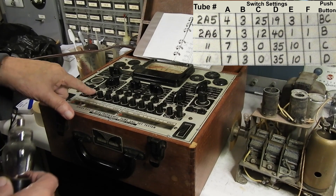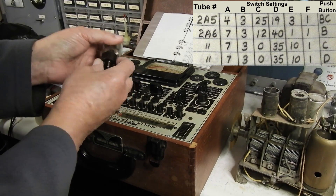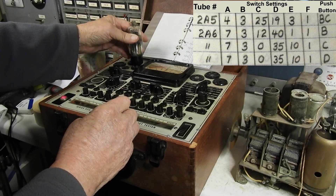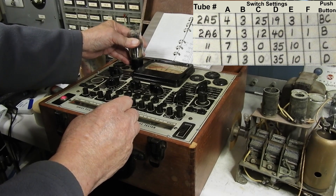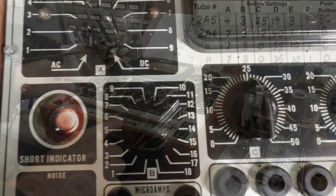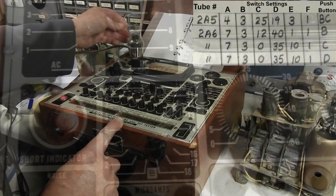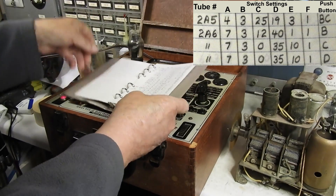I've got this on filament continuity, so when I plug this in, there's the 2 big pins - it goes in this way. From that angle you probably can't see, but the short indicator came on. It's just a little neon bulb, but that tells me that the filament is not open.